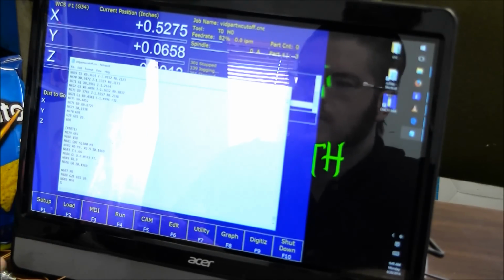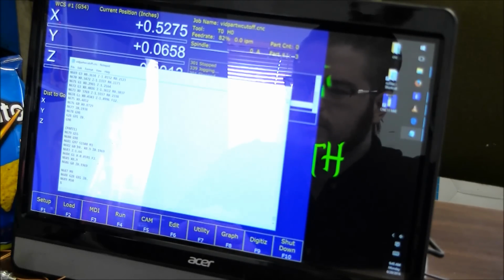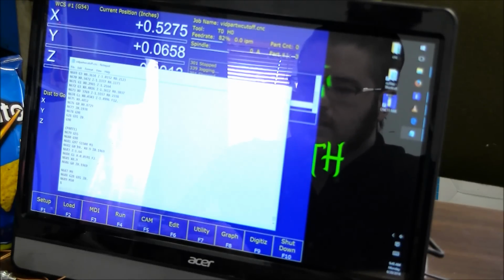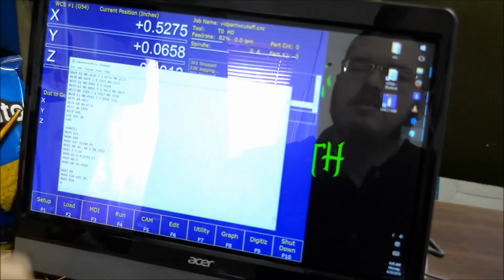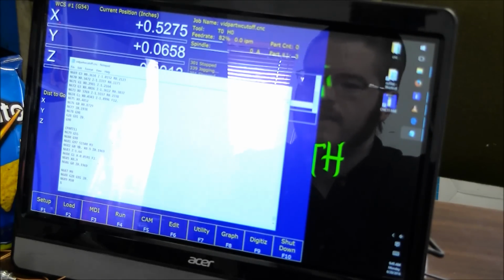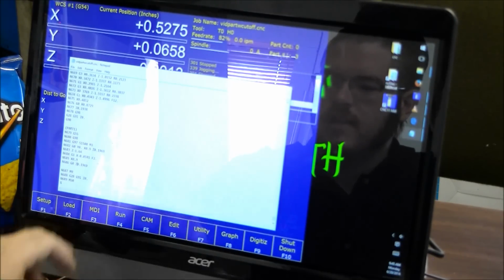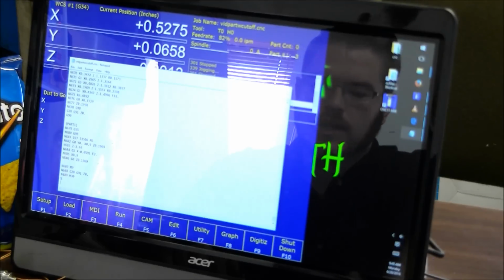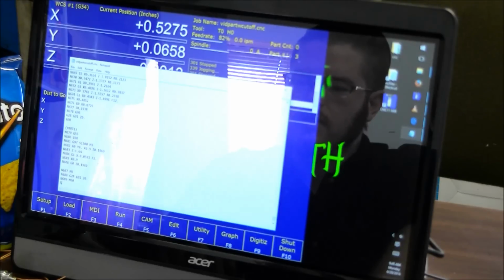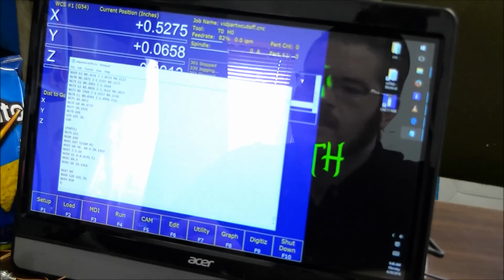If you don't do that, if you leave your Y elsewhere, then when it starts approaching the part, or rather when it starts carrying the stock towards the tool, it could contact the vise, the tool holder, anywhere else but the cutting edge, which is where you set your WCS home location, to Y0. So you want a Y0 right there, and that will get it over that WCS Y0. And so on and so forth. Then, once again at the end of the job, I again reinserted that G28, G91, Z0, so that once it's finished, it does what a mill does and sends the Z axis up and out of the way. Now that's that.